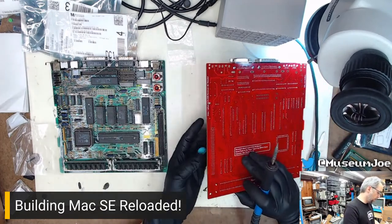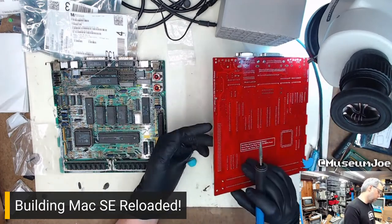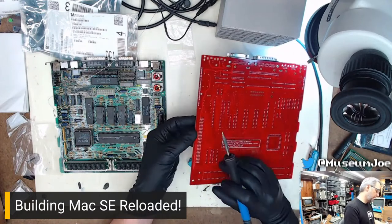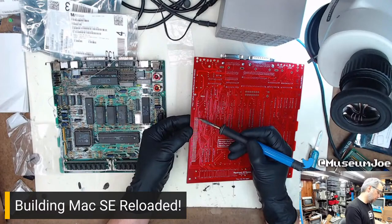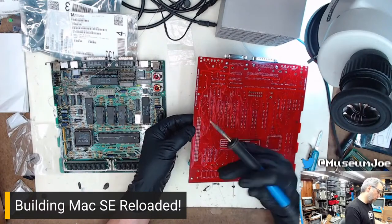And then you lift the board up and then you push down with your finger here. You just push down, squeeze it together, not super hard. You squeeze it and remelt it. And that makes sure it's all the way up in there.